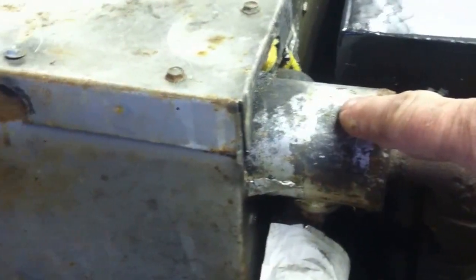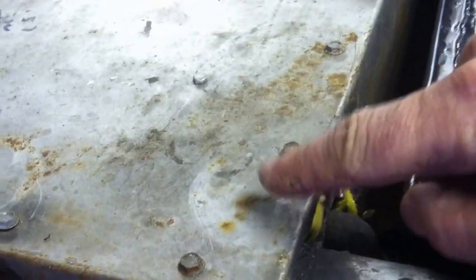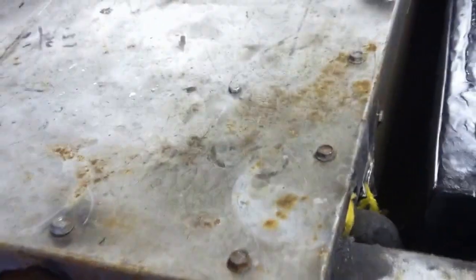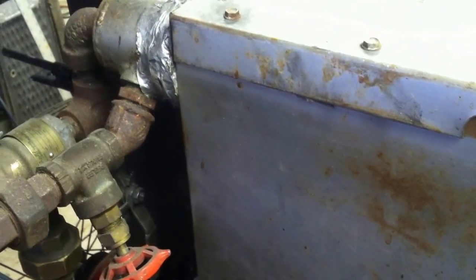This right here is the steam drum, and that runs all the way across to the other side. And the tube nest comes off of that steam drum. It's down low, and it loops back towards the back of the boiler, down and then up front, and it matches the mud drum on the lower section, which looks just like that. It's the same kind of setup.